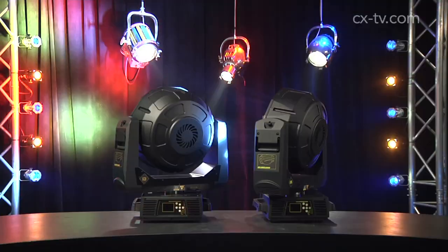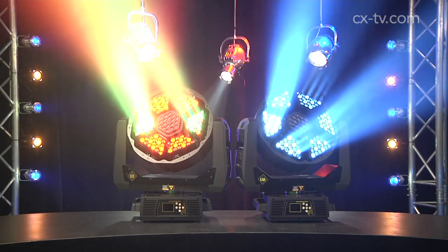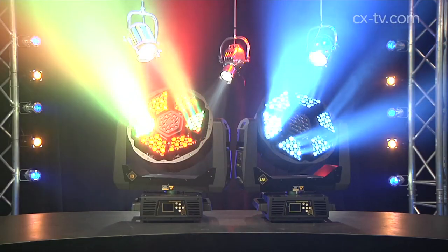It's big, it's bold, it's a bit crazy, it's a lot of fun. Also kind of noisy as well, let's be honest. Just before we get onto that, we should talk about the control options: all of this movement and colour control takes up about a bazillion DMX channels. There is a reduced format control mode for DMX which basically just mimics the same movement and colour on each of the panels. You do still get macro functionality — you'll notice there's two different sets of colours happening on the C1, and that's not something I'm sending it; I've just told it to do a macro.